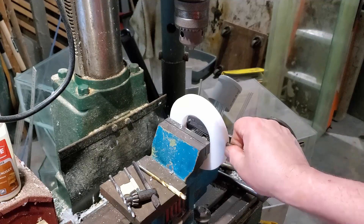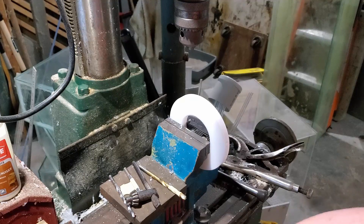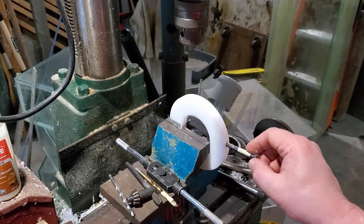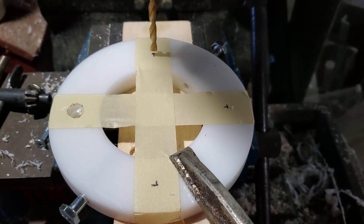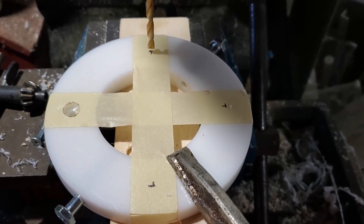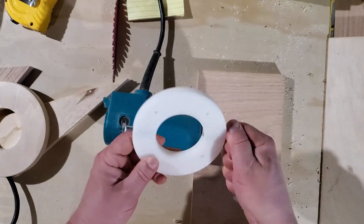What I'm doing here is drilling and tapping. This is the ring that's going to fit around the high-speed router and I need a way of clamping it in place so it doesn't shift around. I'm going to drill and tap one hole on this side, it's going to fit one of these bolts, and then I'll flip it 180 degrees and do the other side. This way I can lock it in nice and tight. The other thing I need to do is drill and countersink some holes into the Delrin plate so I can attach it to the wooden ring. I decided to go with four holes — simply because of ease of layout, it was just a nice cross pattern.